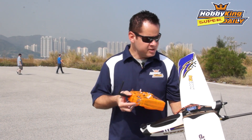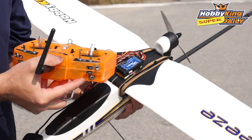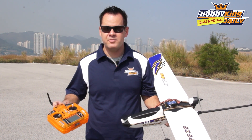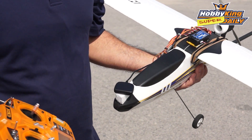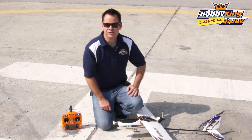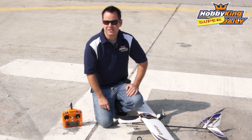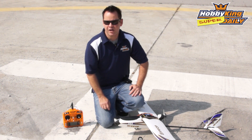What I did was crudely just installed it on top of one of our Breezes so we could demo what it's capable of doing. Inside this it has a barometer so it can maintain altitude. It has gyros and accelerometers to maintain level as well as compensate for any kind of disturbance whether it be air or whatever. It also has GPS which allows it to have return to home functionality. After your initial setup, put the battery in and let it sit for about 5 minutes so it can grab all the satellites it can. After that it can do a hot start so it'll remember that position.